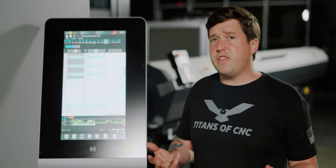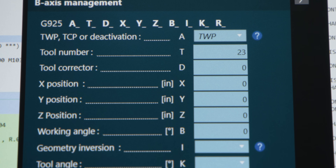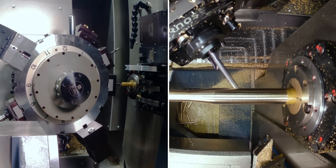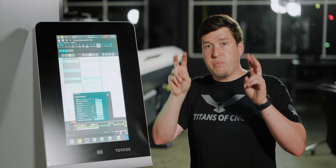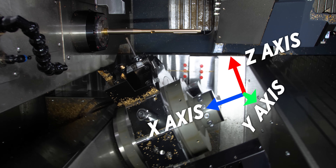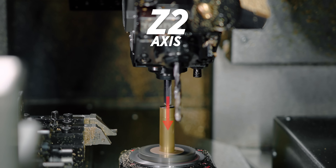So how does G925 work? Well unlike normal machines where you have to memorize all this stuff, I can just click on my G-code, click on wizard, and I can see all the possible variables. The first variable is TWP — Tilted Workplane. What that means is no matter what angle my tool is at, the tool itself is the programmed Z-axis. When I move at an angle, I'm actually using two axes at once, but in my program I'm only using one — it's called a virtual axis. So it doesn't matter if I'm at 50 degrees, 40 degrees, whatever — Z is going to be in line with my tool.